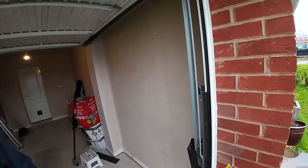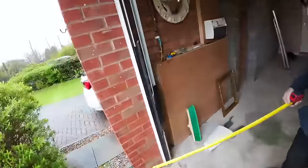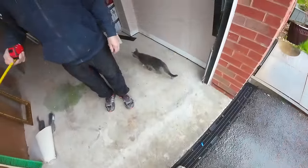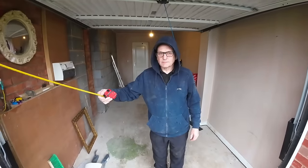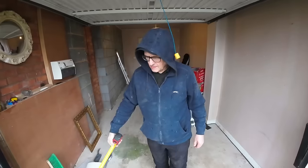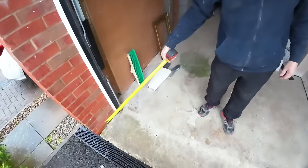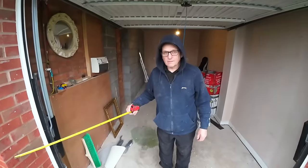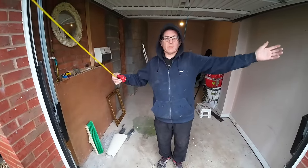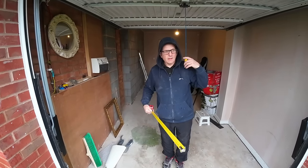We can, but it's a solid wall. It's a pillar, isn't it? There's no cavity there. Oh, yeah. It's a solid pillar, so there's no point cutting the cavity out. So, vertical damp, as we always do. I don't think the vertical damp needs to go past the window. No, it's just being the way, wouldn't it? Yeah. So two out. One course of reds. Brickwork. Sill, which we've got to order. And do that, bring the brickwork in, and then just do the block in the back, do the cavity.